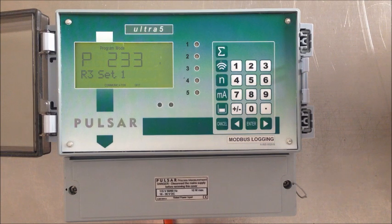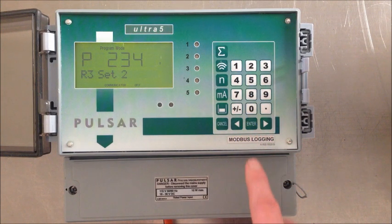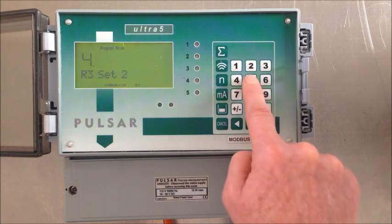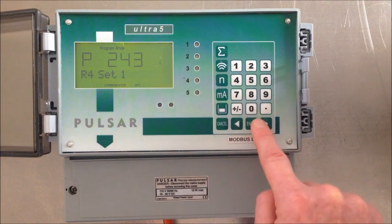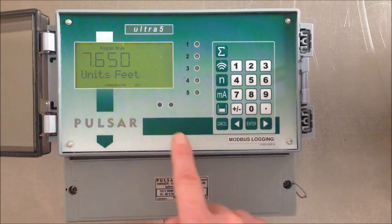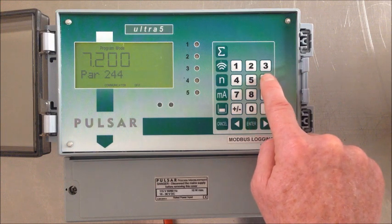Now the lag pump — if the lead pump is struggling to handle the flow in the well, we need the lag pump to come on. We're going to have that lag pump come on at 5 feet. And once again we just need a value below that for it to turn off, which in this case we'll have at 4.5 feet. Relay four was what we set as a high-level alarm. We want that high-level alarm coming on — we're going to set that to 7 feet. You'll also notice it's automatically giving you set points which are close to where they need to be, based on us telling it what the application is. And we'll have that alarm going off at 6 feet.